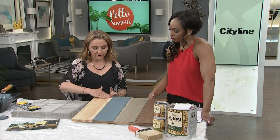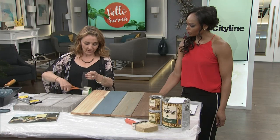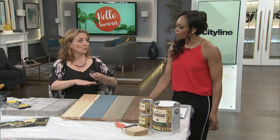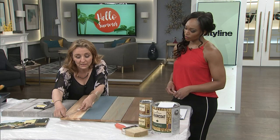The other important thing I've learned recently is that wood fibers raise if you've washed your deck or haven't let it dry completely. When you get wood wet it tends to raise and swell. You want to get those wood fibers off the top, and that's why it's so important to sand — whether you clean it or do a great job, if you don't sand it... It doesn't have to be sanding with a big machine, just a pole sander.